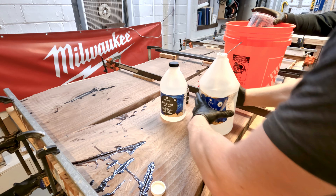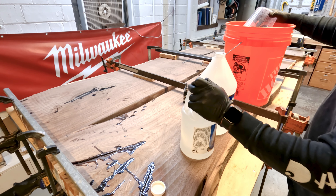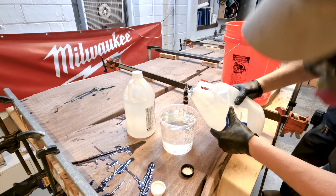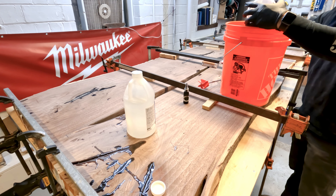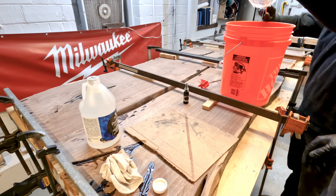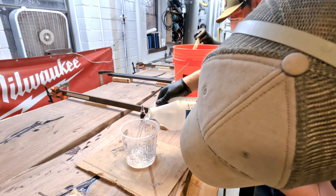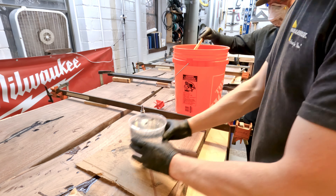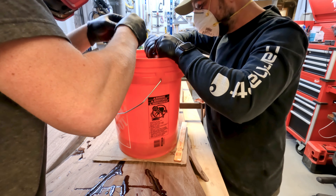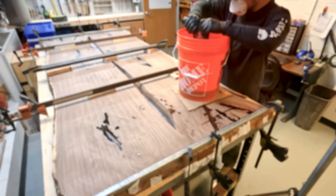For this project we are using Pro Marine Supplies Pro Pour epoxy. We're not sponsored by them — we pay full price from their website — but this is the epoxy we've used for a long time and it has produced great results. If you guys have an epoxy you prefer, leave it in the comments. We're using this deep pour epoxy with a black dye and it'll give the river a nice jet black look. One thing we really make sure of is that we mix it well — we like to use a drill with a paddle mixing bit. You can't over-mix this stuff, and if you under-mix it you could lose a lot of money fast with how much this epoxy costs.